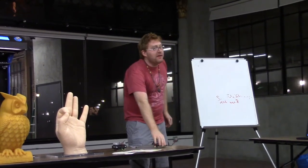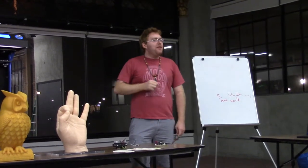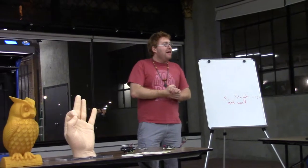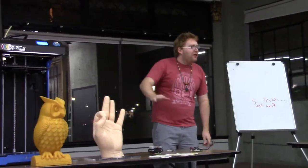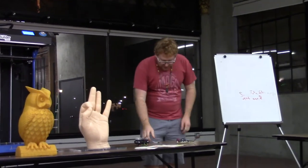So effectively the design is to run it at high power and then turn on and off my constant current controller so that the LEDs receive effectively less current and dim. Unfortunately, LEDs don't dim linearly, which is why you can hardly tell that I'm dimming them, because I currently have it set up to dim linearly.